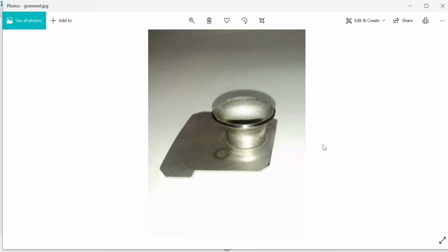In the current system, we have utilized not only a 3-axis system, we have also designed a particular fixture to make sure the component doesn't lift off. Since it's a very small component, we need a fixture where the top end of the grommet, the cup, sits exactly onto the fixture and doesn't move during weld, because the weld temperature here shoots up to 3000 degrees centigrade, because that's the arcing temperature for TIG.